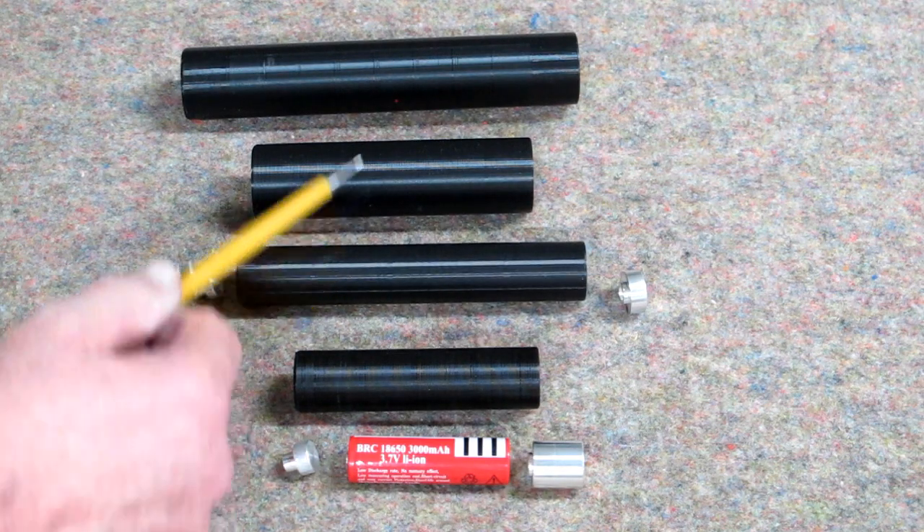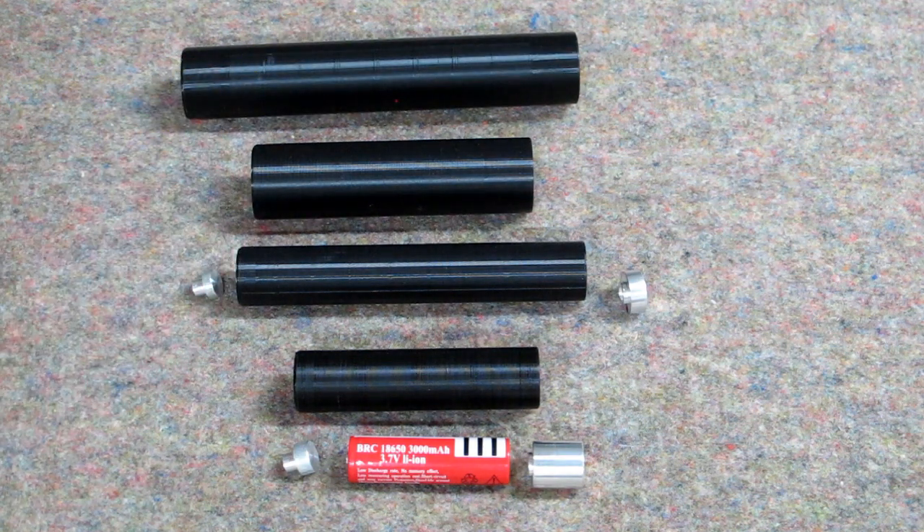The three-cell adapters essentially turn those flashlights into a five-cell equivalent. Five alkaline batteries would be seven and a half volts, and two 18650s together is 7.4 volts. Couple that with an LED bulb and they will be bright and the battery will last a long time. Plus these are rechargeable and they don't leak.